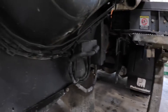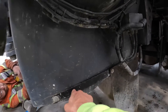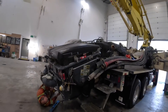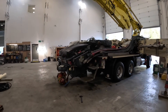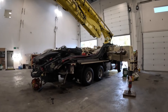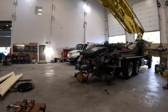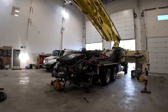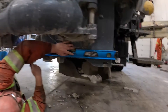Our little apron here — the washout apron that keeps the washout splash from getting all over the undercarriage — we'll just redrill that hole right up about here, because this is going to come across and intersect and we'll have to trim this extension off. That's always been kind of a pain with this pump, especially doing a lot of jobs up on hills, in and out of driveways. Maximum approach angle is of huge benefit to us, so we're going to improve that here today.